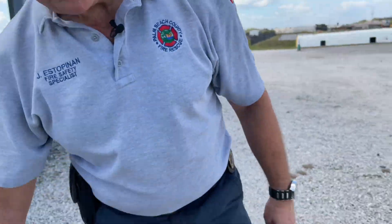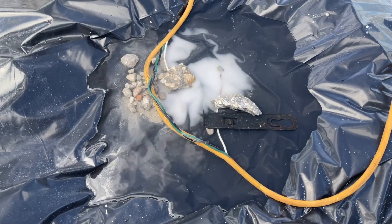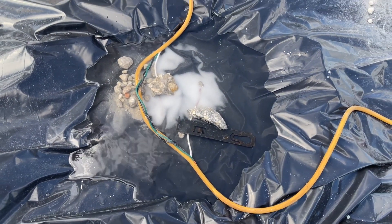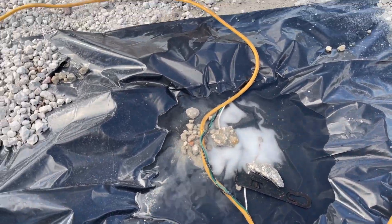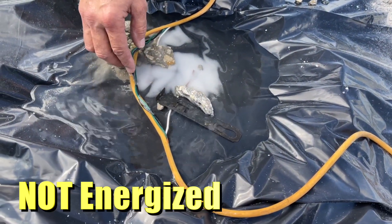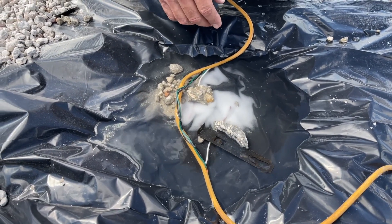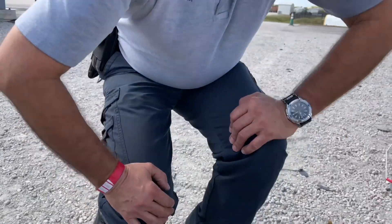Now, that being said, what happens when we go through a puddle of water and the safety net is gone? Let's see what happens. This is a very typical scenario — we have a puddle of water, we have a damaged cord. You run that damaged cord through that water. Once we energize it, this green wire is your ground, and that ground is gone. We no longer have a ground, so your safety net is gone. Electricity is always going to take the path of least resistance to ground. So if you do not have a ground, who becomes a ground? You do.